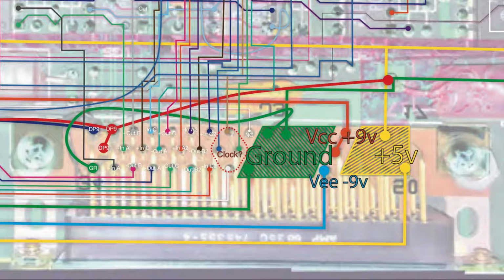It was also pretty easy to figure out what the pins did on the 50-pin connector on the right-hand side. It feeds the board power, and it does serial input and output through RS-422. RS-422 is a standard serial connection that was designed to be robust against electromagnetic interference. It's a pretty standard connection. This board seems to have 6 different channels. That's a lot. Some of these are connected to the 9-pin connector directly, and so I don't really know what they do without knowing what that 9-pin connector does.